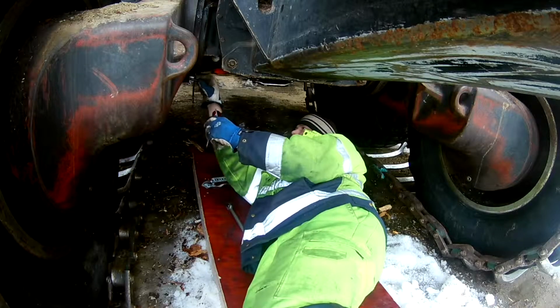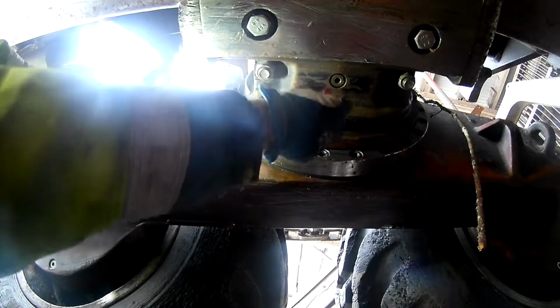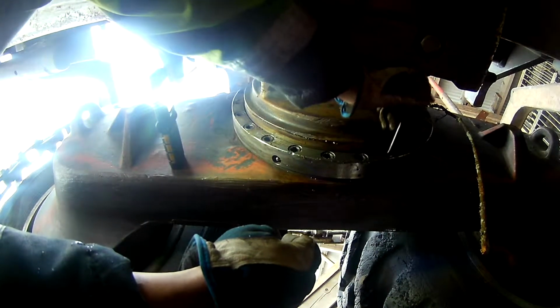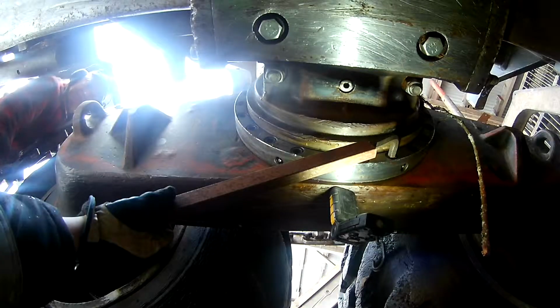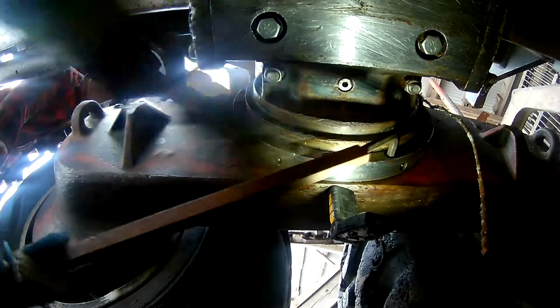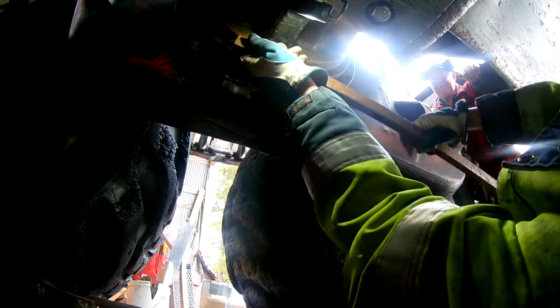Cleaning up a little excess. Also wanted to check the bogie mounts on the forwarder. Cleaned up the bolts to be able to get a tool in there. With the amount of broken bolts on the machines I found, I figured it would be best to check these. I didn't have any of these broken, but all that I could check seemed to be good, at least.